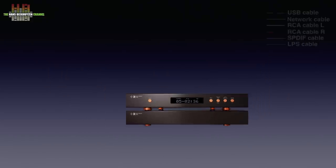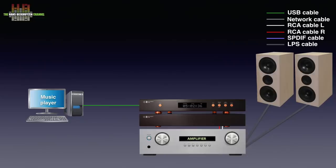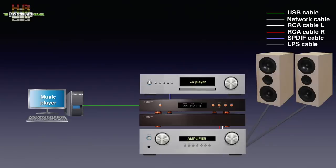The analog outputs of the DAC are connected to the amplifier over either RCA or XLR cables. When you want to play music from your PC or laptop, just connect a USB cable between the computer and the May. If your source is a CD player, connect it to the DAC over either I2S using an HDMI cable, AES-EBU using a 110-ohm XLR cable, SPDIF using either a 75-ohm RCA cable or a 75-ohm BNC cable, or Toslink using an optical cable.